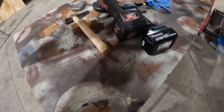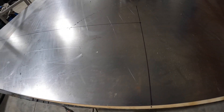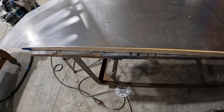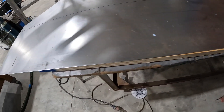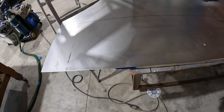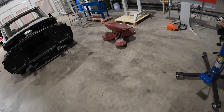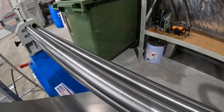We've pretty much got our side piece finished — bead rolled the center section and got the lip inside all ground. Now it's time to actually cut the curved fender and tack weld that onto the edge. Here's my next piece cut out — this is for the arched section, it's about a meter by 11 inches. I like to use the straight edge from the sheet metal when cutting with handheld shears so I know it's dead straight. Now we'll take it over to the roller — I've done a few test runs to get the right amount of curve — and we'll put a gentle curve on it, bending the rest by hand if needed.